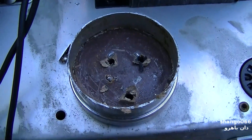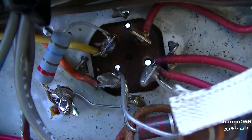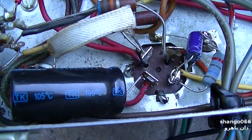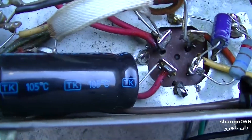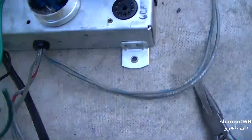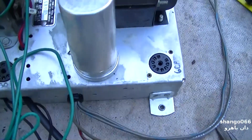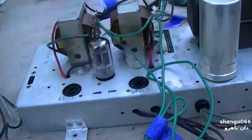I'm going to put two capacitors inside and two underneath. You can see I've drilled three holes here — one over here for the ground, two over here for the positives. We've got two underneath for the cathode bypass. One cathode bypass is over here, the other cathode bypass is here, and then the main filter capacitor straight out of the tube. Over here we've got the other two. We put this right back on top like that, and I'm going to wrap some aluminum duct tape around there to secure it. Here's the completed unit.